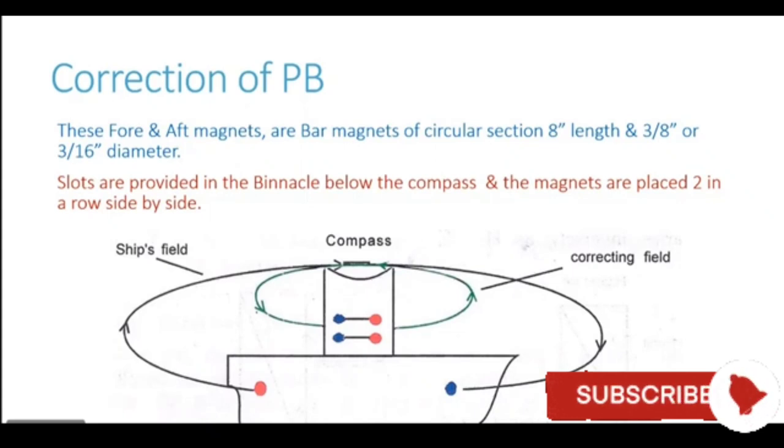Now, why are they placed in pairs? The reason is that exactly in the middle of the binnacle, exactly below the compass, you have a periscope which is going into the wheelhouse. It is with the help of the periscope that you are able to see the magnetic compass at the helmsman location from the bridge. So because of this periscope, we cannot have the corrector magnet exactly below the compass location.